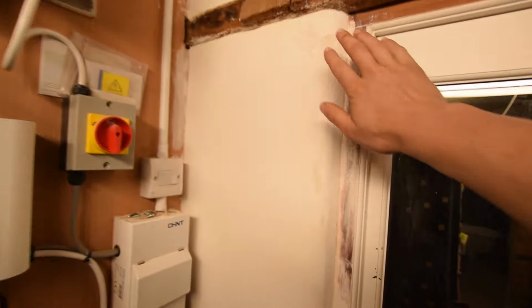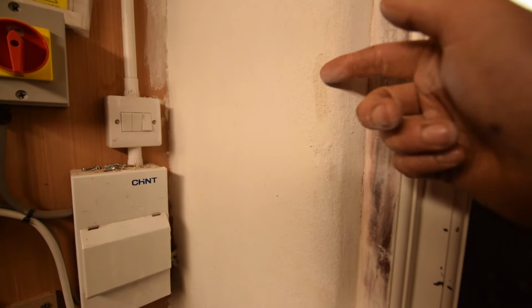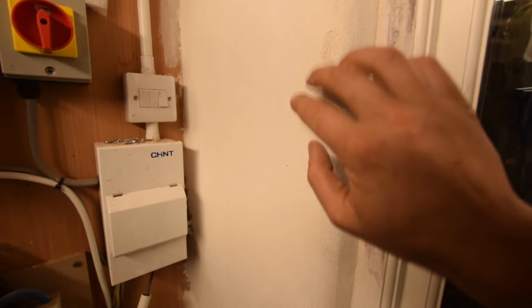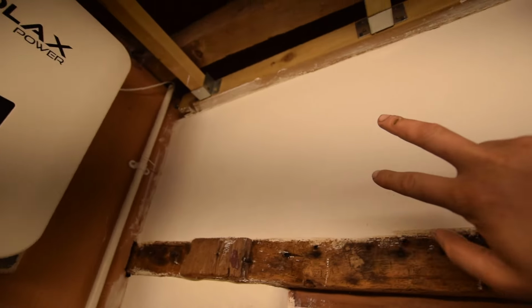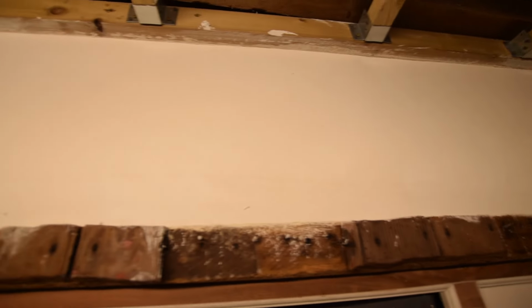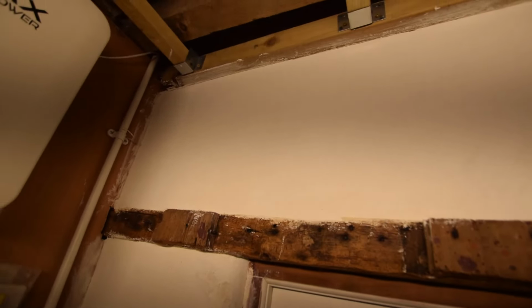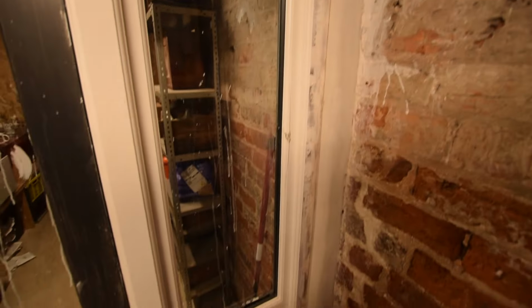This is looking good. There's a couple of marks, like here, where the mesh is coming through a little bit, but if it was painted you wouldn't notice that, or I could fill it up a bit. It's tried cracking, but I think the mesh has helped it out, and I could have done with watering it a bit more as it's drying out and before it's carbonated, but it'll probably still be carbonating underneath for a few more weeks, to be fair. But yeah, looks pretty good.